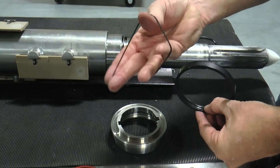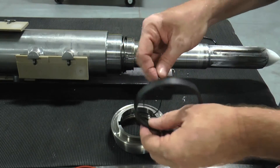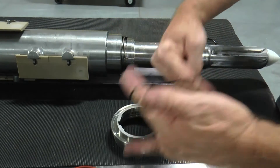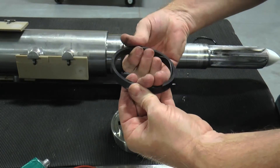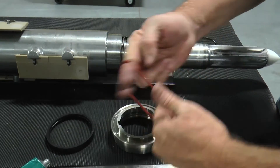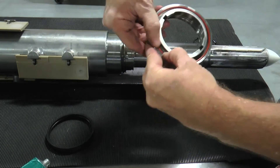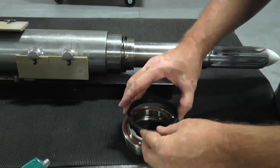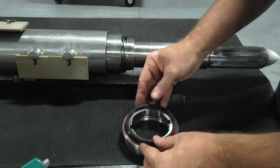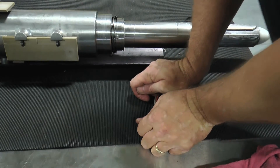For the two-piece seal design, the seal body insert must be fitted with an O-ring on the inner diameter. This O-ring will need to be slightly stretched before it's positioned. Additionally, the seal body must be fitted with two O-rings. The outer seal body insert O-ring will need to be stretched and positioned in the outer edge of the seal insert groove. Next, the seal body insert is pushed firmly into position.